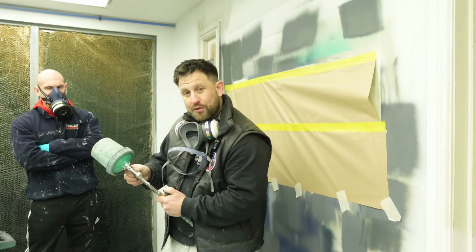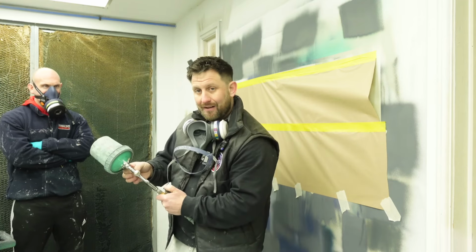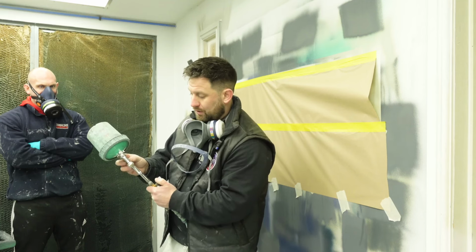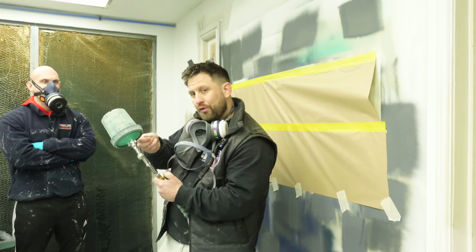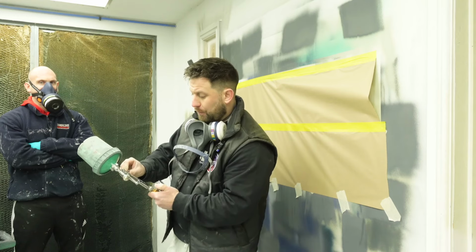And what I'm going to do is once I've got that fan all the way out to that click, yeah, I'm going to go back 3 times. 1, 2, 3. And that's about 3 half turns. The fluid on this gun, I open all the way out.